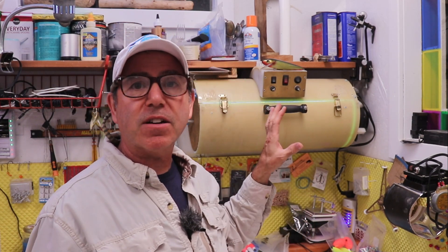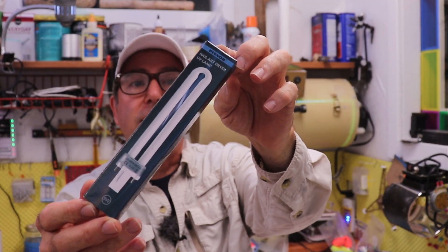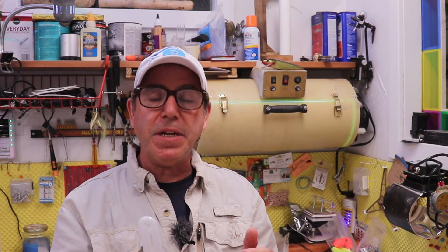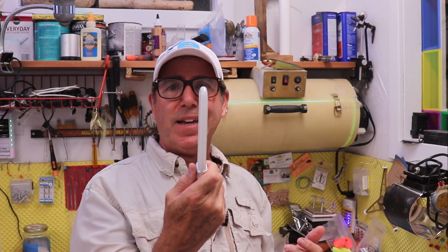So what lights should I buy — can you buy cheap ones? The lights in my box are essentially two of those fingernail-setting lights that have four of these little UV tube lights with a two-pin base. They are nine watts, 365 nanometers. Each one of those lights came with four tubes, so all I did was disassemble two of those little light sets and reassemble them inside my box with the controls up top. Nothing fancy — a little bit of soldering — and they're really inexpensive and come with the bulbs.